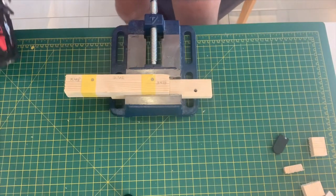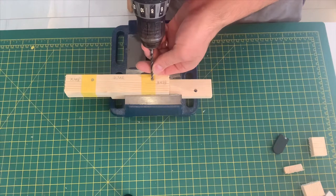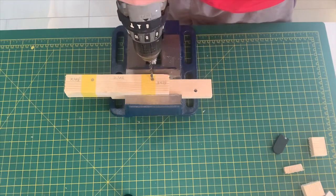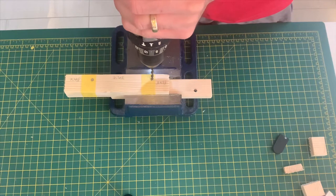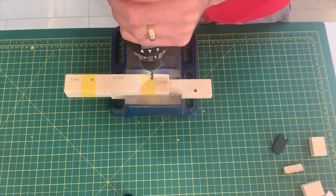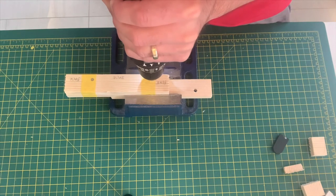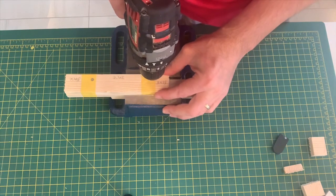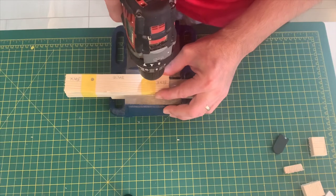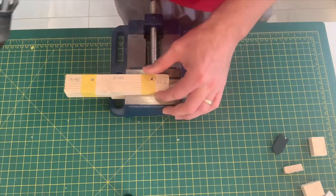Place the drill in the center of the hole, make a little piercing, then lift the drill so it's at 90 degrees and slowly press the drill on and slowly drill through, keeping the drill nice and steady and straight. Once through, to get it out, put the drill in reverse, hold on to the piece of wood, and slowly drill back out. There's your hole.